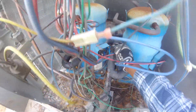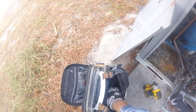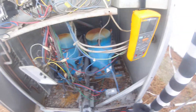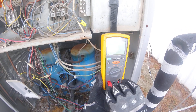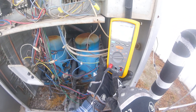Get all that out of the way. Get my favorite meter back out. As you saw in my last video where we checked the ground — I told you I was going to take the leads off that other compressor. Now I already took the wiring off this compressor. I've got my ground wire on, so I can check insulation as well, and I'm going to do both.